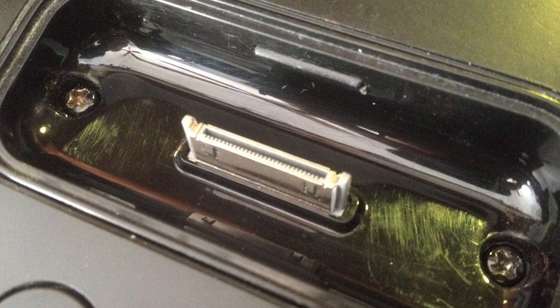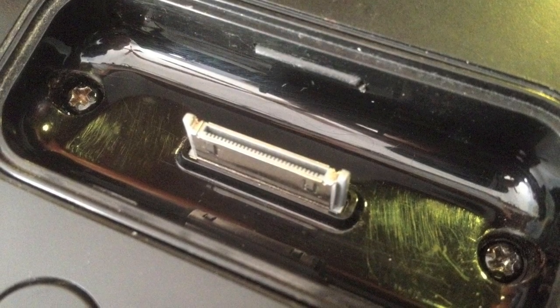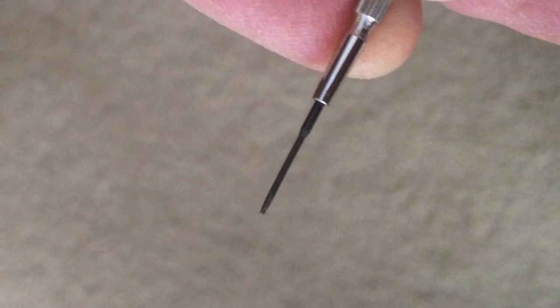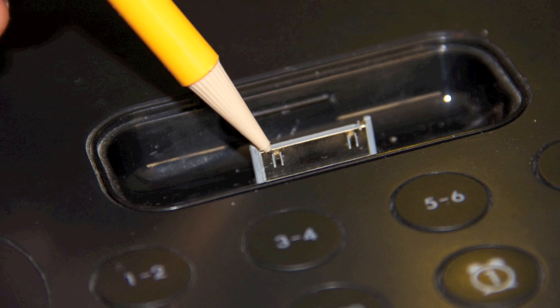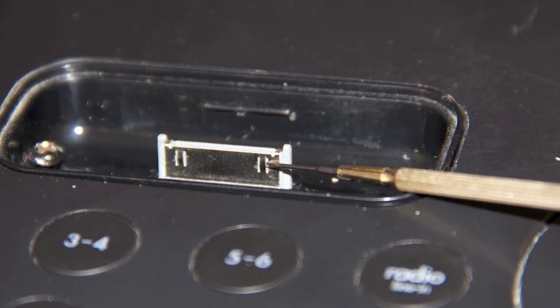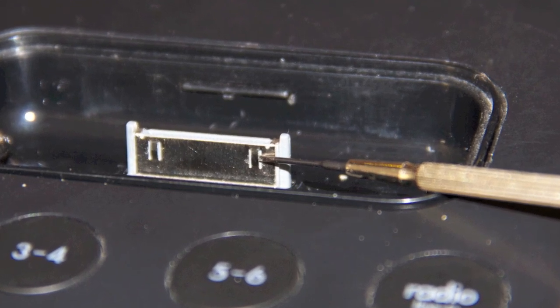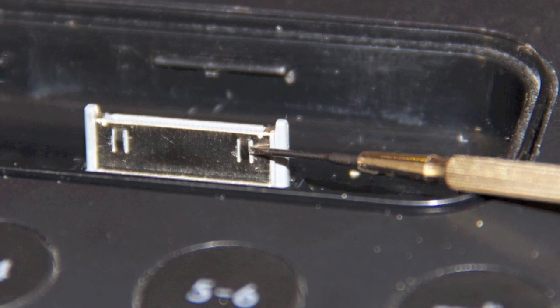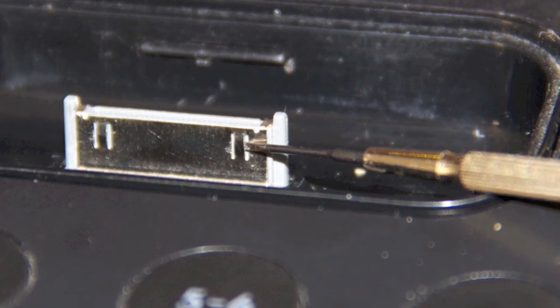The clips are those incorporated in the steel structure of the plug. All you need to do is insert a very small flat blade jeweler's screwdriver under the clip and turn the screwdriver to cause the clips to stick out more. This will force the contacts on the plug into more pressure against the receptacle and make the connection work once again.